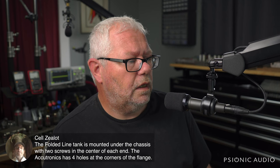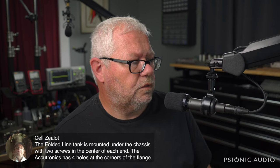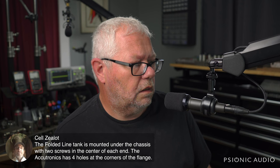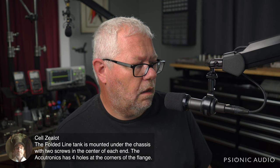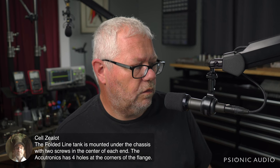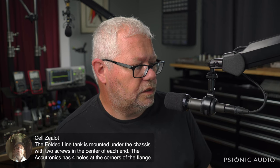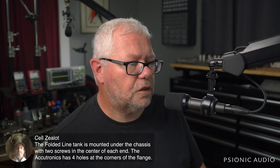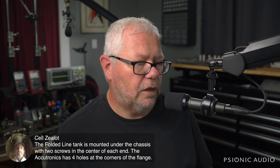Yeah, I'm seeing early models of the JC120 is A. I'm pretty sure it should be the E for most of them. Let's see. Yeah, I'm seeing a lot of 4A tanks for that. Maybe they did something. Maybe Roland was saying, well, every tank out there is designed for tubes, so we'll do a solid state circuit that has that impedance. As far as mounting it, you may have to get creative and mount it somewhere else in the amp.